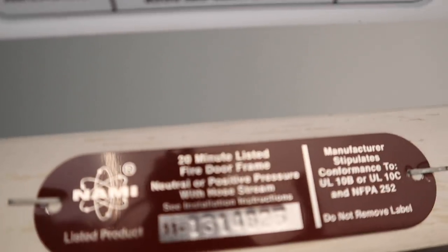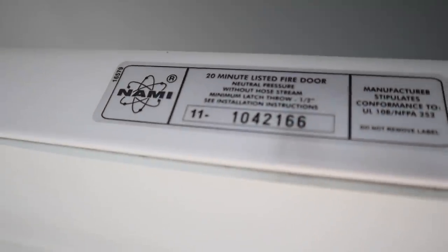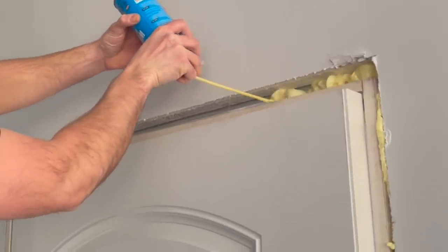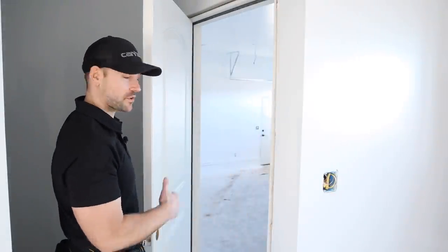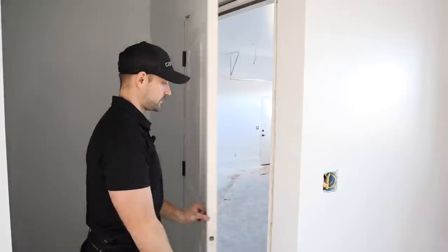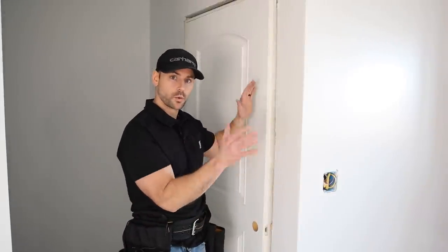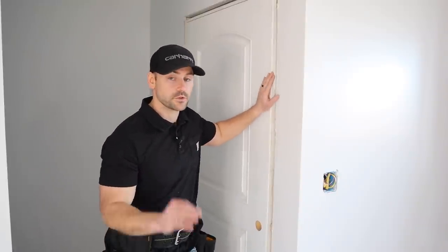To check if your door is fire-rated, open it and look on the side of the jamb — this one has a 20-minute rating stamped right on the frame, and the slab also has the rating on it. On the final inspection, the inspector will open the door and check for the fire rating, so make sure you have the right door. I'll also use spray foam around the door to insulate it. Testing the door — it opens, doesn't keep swinging or want to close, because it's set plumb. Nice reveal, door doesn't look warped or bowed. Watch out for doors that come warped from the factory. Check out the linked video if you need to know how to install an exterior door.